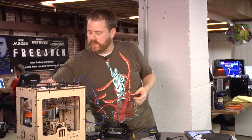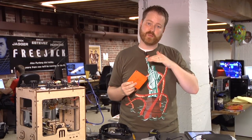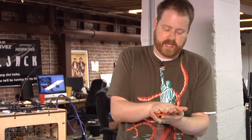What that is, is basically you take this thing that's normally a piece of plastic — the plastic gets laid down on here and your build comes up from here — and we replace it with a heating element and a piece of aluminum that runs about 100 to 120 degrees Celsius. What that does is prevent the plastic from cooling unevenly and curling up as it's laid down on the platform.